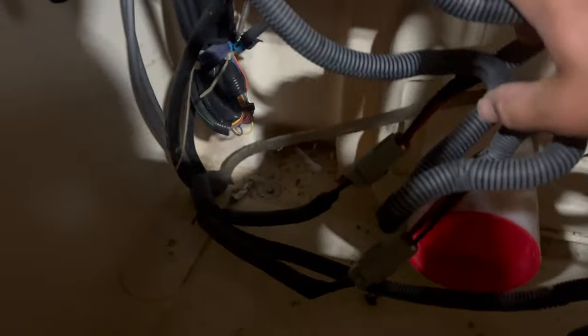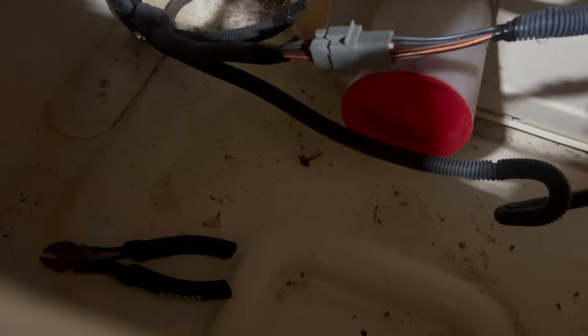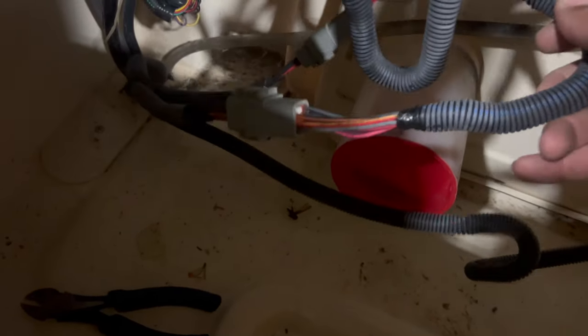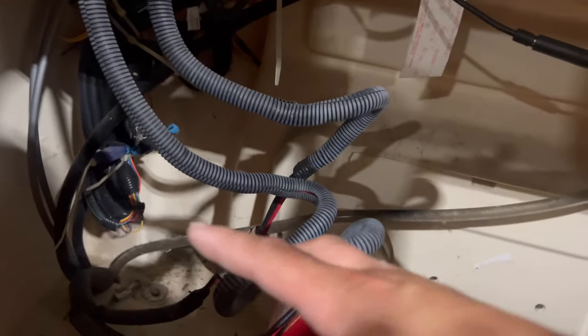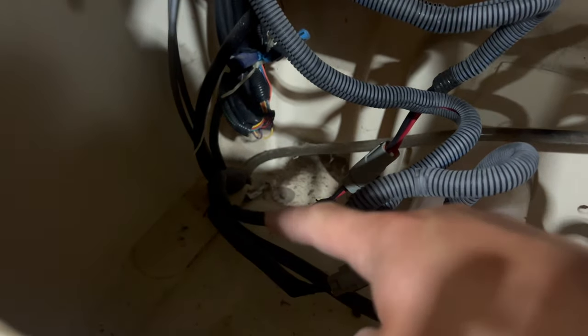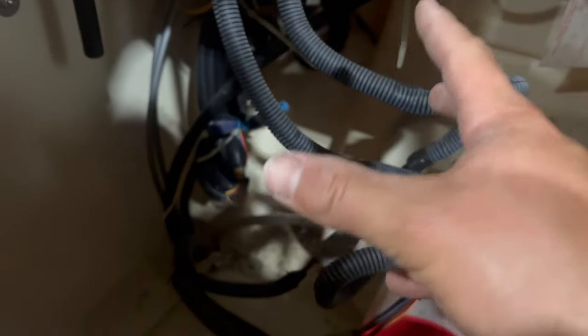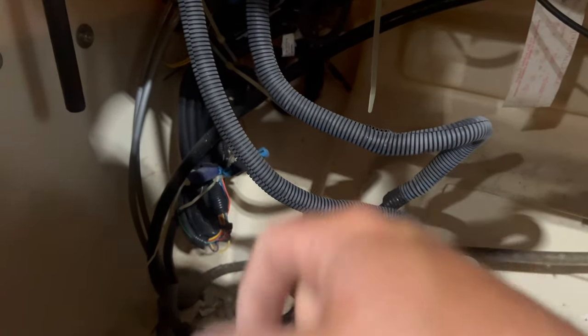Here's a perfect example — I cut a bundle of wires and check this out: this big wire going down through the floor. I know I'm going to need to push that down through. That's all stuff from the boat manufacturer in terms of accessory electrical. This is our accessory wires coming from the switch panel. This is our main power, and then this is our stereo. So that stuff's all just going to stay together — I just have to unplug those three. Once I pull that down through the floor, I'll remove this little plate to get more access, then move on to my motor rigging stuff tucked up behind there.